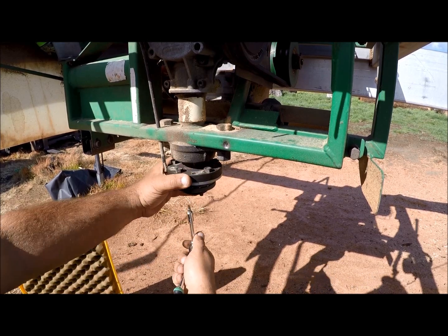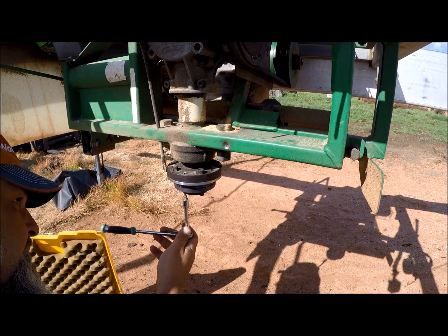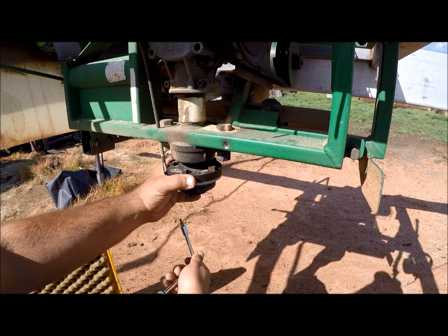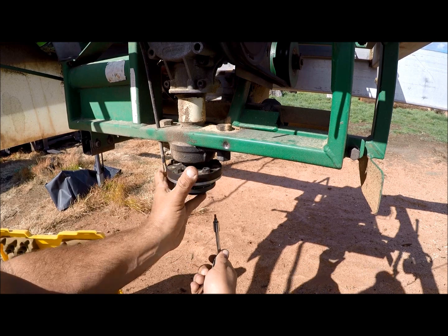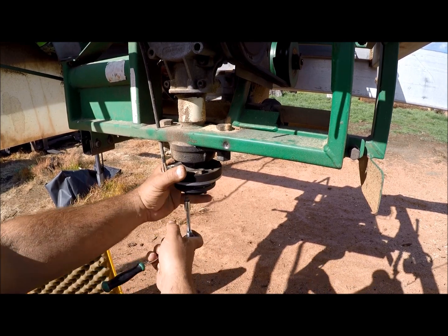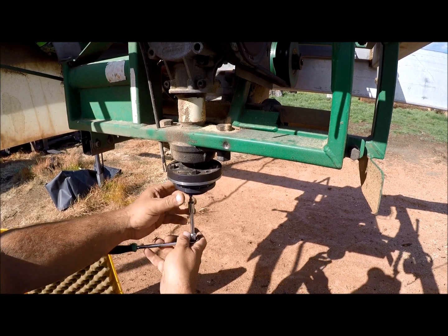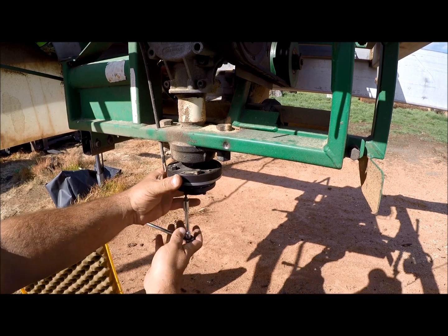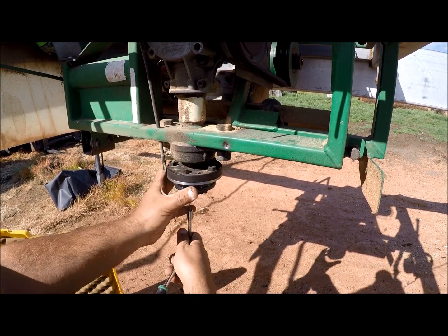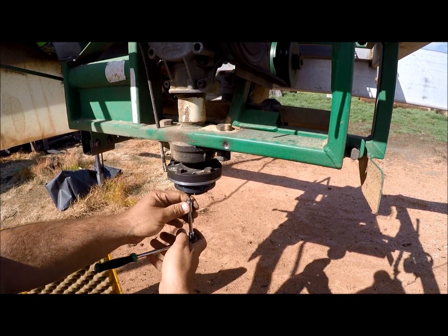When you need to take it apart, take these screws out and put them in the threaded holes. Tighten the screws back up and it's basically its own pressing mechanism — it presses itself apart, so you should never have a hard time getting it apart. If you have a bolt that starts to strip out, go get a new one. Don't reuse it — if you reuse it, you're just asking for problems. Also make sure to clean these Allens out before you put the Allen driver in. If they have sawdust in them, your Allen driver won't reach the bottom of the socket and you'll strip the screw.